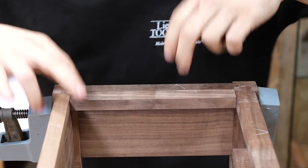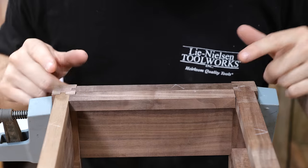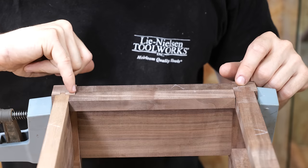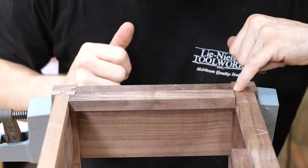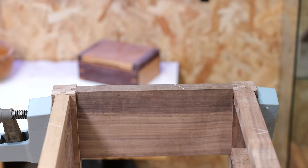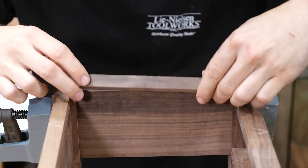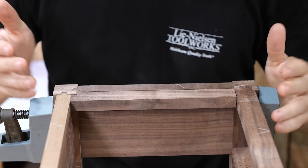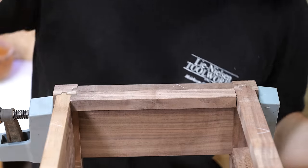Go over the end grain and down the faces on both top and bottom, then spin it 90 degrees with the same measurement, go over the side and meet up with the lines we just did — that gives you a nice corner to remove. We could just leave this off the saw, but I'm going to chisel back to the line. It fits nicely — snug, it holds itself — but I just don't want it resisting the mortise, so let's take a very light shaving off. That was literally one pass.